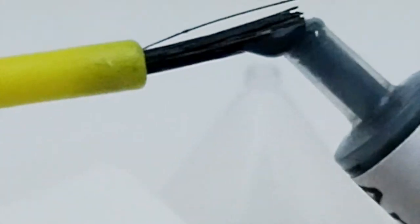If everything's already connected, like the wire and such, I would just brush that stuff on there, just slather it all over the place. And this compound will sacrifice itself over time and prevent things like oxidization and rust. Okay, and you'll do the same thing to the other side. You'll apply just a drop, a dab will do you every time. You just put it on the screw, and there you go. This should be good to last for at least a season, if not more.